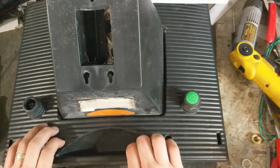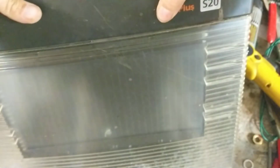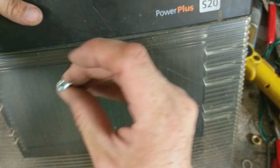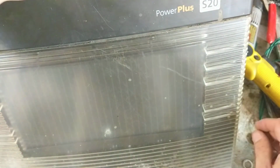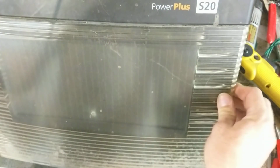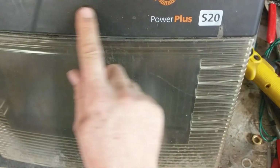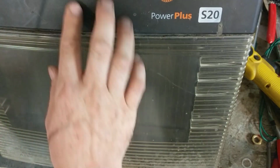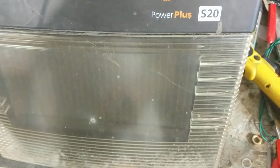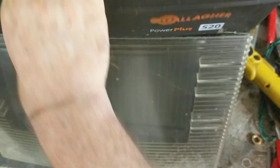So you can always put your fingers over it and lift it up, so that way you keep track of them, because there's a Phillips screw in the back side. This one is in there, didn't fall on the table. So now this front and back comes apart, and this flat plastic fascia up here has a foam gasket between here and that's this clear shield, and it's kind of stuck, so you've got to pry it away from it.